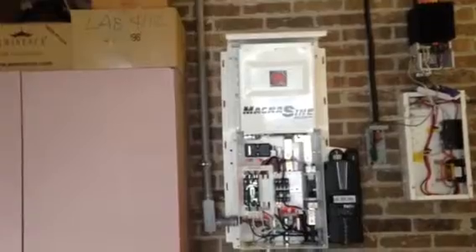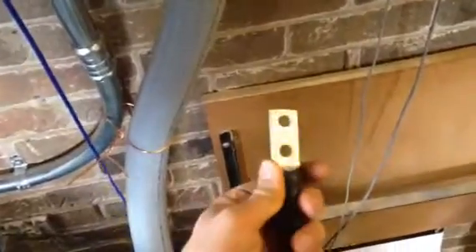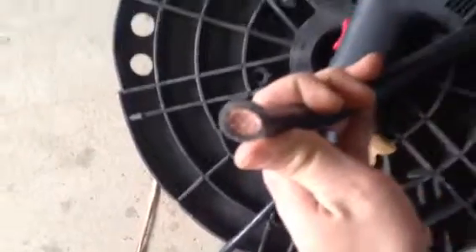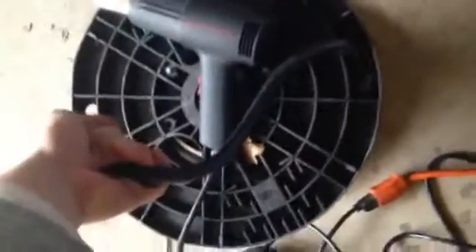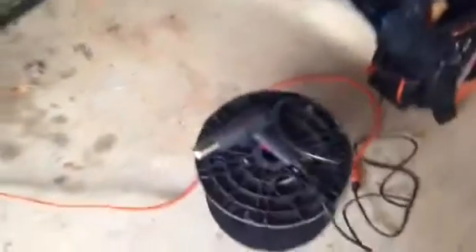Like well pumps — that's really the biggest thing that we like to run with it. So right now I'm just making up some battery cables. Got my battery cables getting ready — heat shrink, nice Panduit lugs, 3/8s for fine-stranded. Using some really nice fine-stranded wire. It's a very fine-stranded wire, really nice to work with, and it's also a code-approved wire for running battery cables.